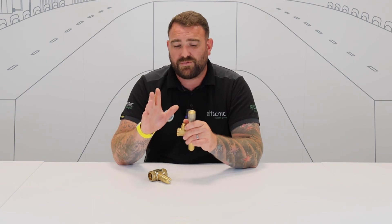Should you start to lose fluid from the system, there's also an anti-vac valve on the top of the valves. What that will do is open up to allow air to start pulling in, so you're not going to get an airlock — you are going to keep that warm water pulling through the system.